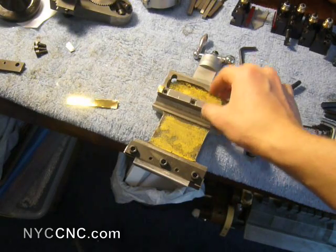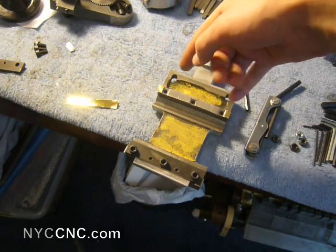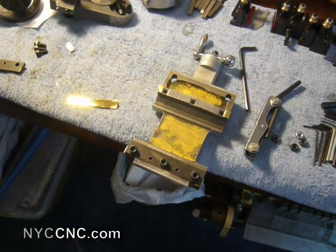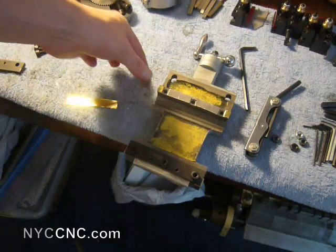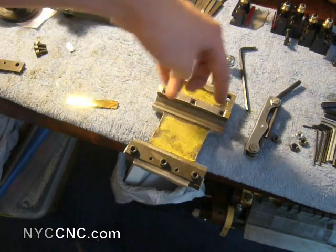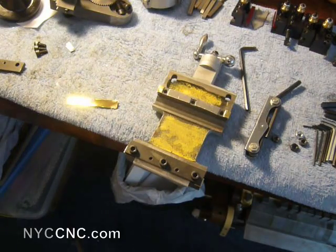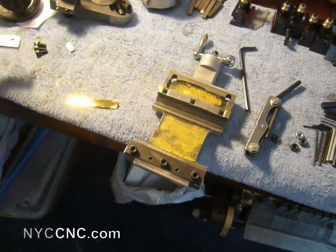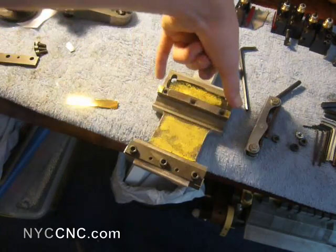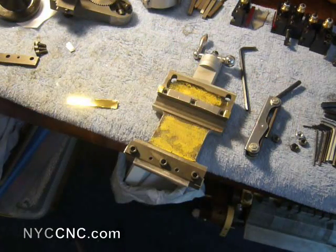I didn't think about it, but I should have gone ahead and made the shim the full width. I was experimenting with a different design earlier. It should work for now with the little side pieces — those are important. Otherwise, if you don't have shims on the outside edges as well, when you tighten the two screws you'll end up pinching and bowing the cast iron again, and your gib will be tighter on the ends than in the middle. The idea is to have the gib flat across at just the right height.